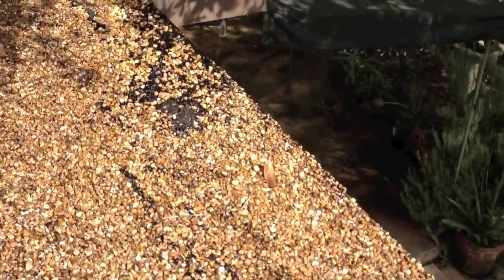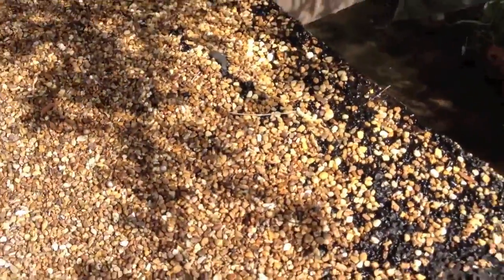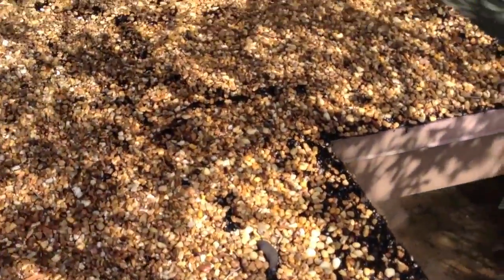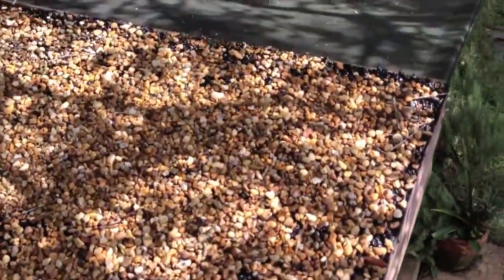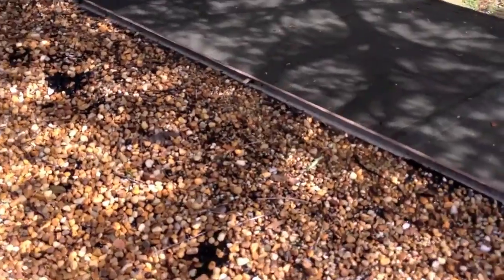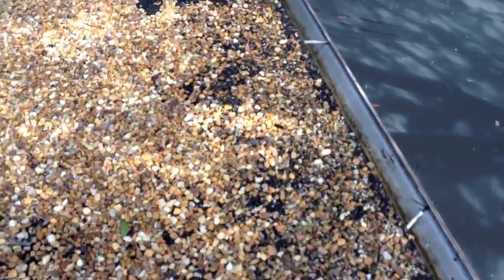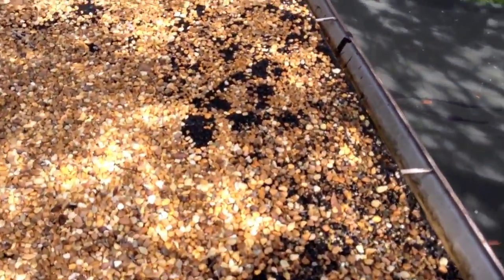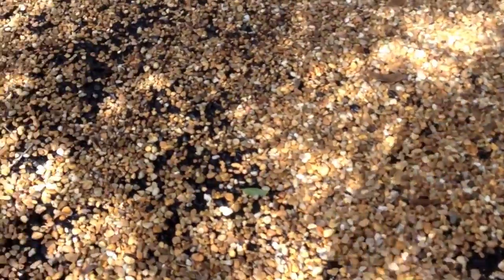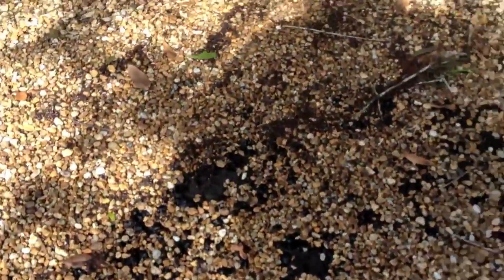Water is being retained here as well, and it appears that repairs have been made the whole way around the perimeter in a number of locations. You can see the difference in the aggregate size and color, which indicates repairs. There are also many darkened areas where the aggregate has washed off and has not been properly embedded into the repair areas.